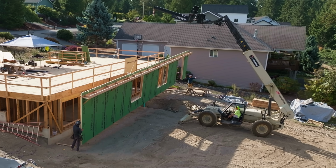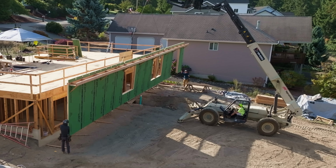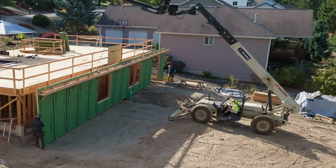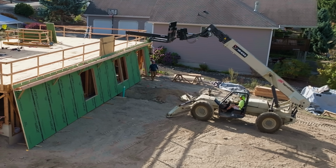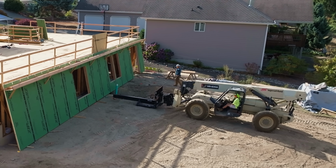Okay, so again, kind of a back to basics. Center stays consistent all the way up. Even as materials change, the centers do not. Incidentally, this was a 64-foot wall with the soffits attached. The zip bar is going to hang up to catch the bird blocks. We just built it and lifted it up, got it out of the way so that we could work on some other rake walls. So stay tuned for that.